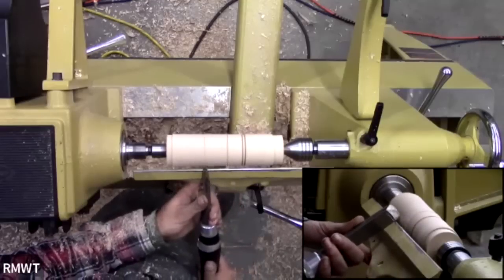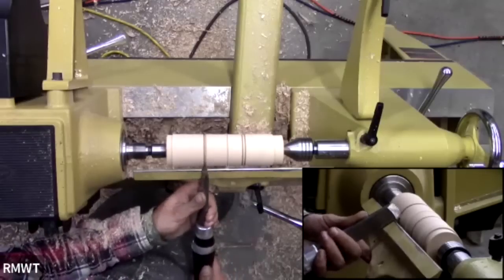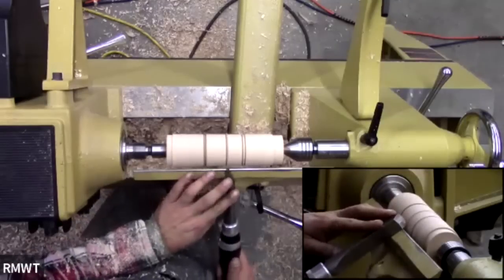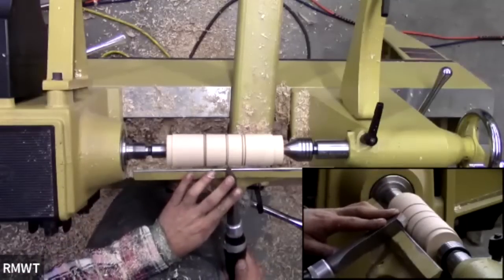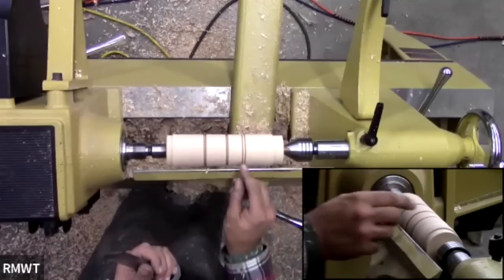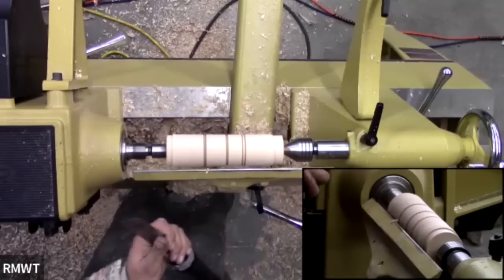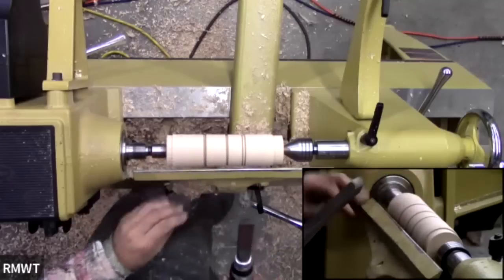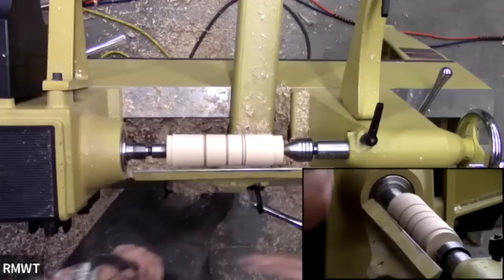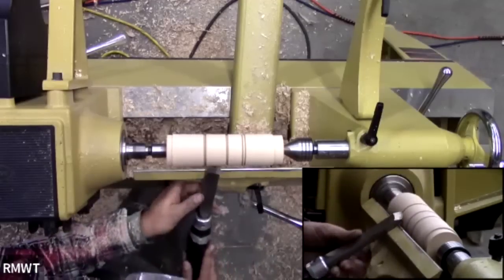And let's take this over a little bit further. Now, if you have to make a bead this way, where you just have two V grooves on both sides, better do it this way, as I see it, for the sake of practice. And that'll reinforce a certain point. Now, it's simpler to roll a very narrow bead like that. It is far more difficult and worthy of practice for the sheer slice and practicing that, not just to go from the headstock to the tailstock, but rather to roll a larger bead like this.